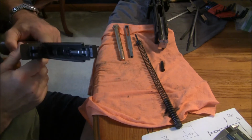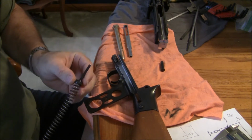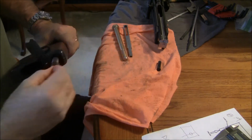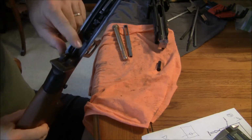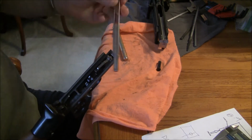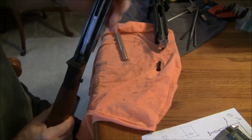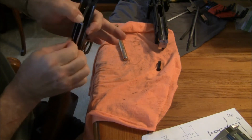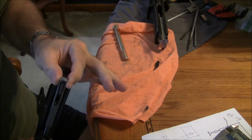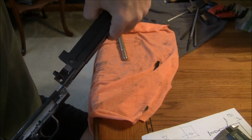This was a major mod. The other mods are the stock recoil spring, this rod that is inserted through the butt, this is trimmed shorter, it's cut down to clear this, and I'm going to call it a push rod. This is the part that straddles that, slides on here. And this is the part that when it's fired, it'll travel back in the buttstock. So this clears the hammer, and this piece interfaces on the milled slot in the bolt carrier to keep it from rotating.